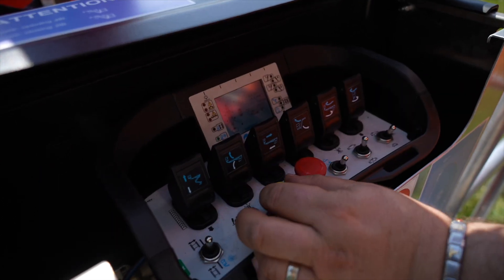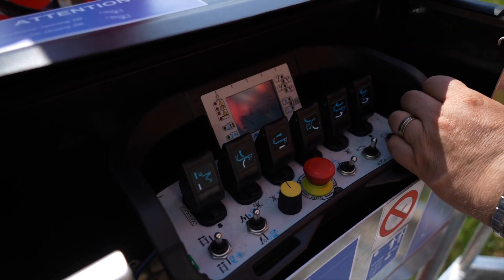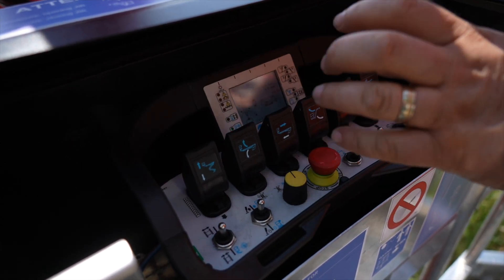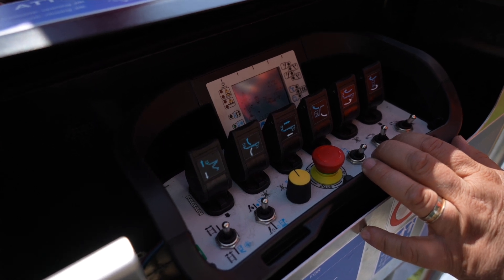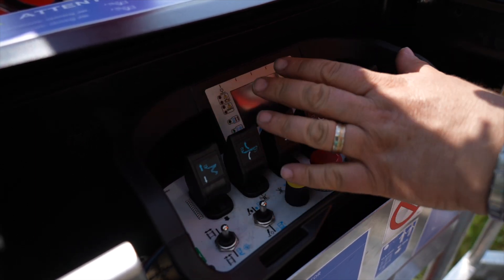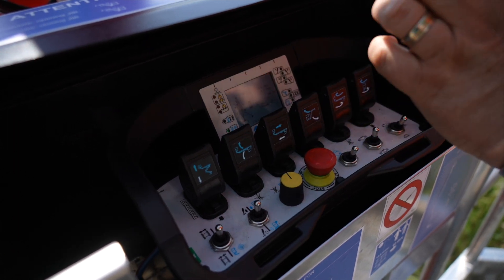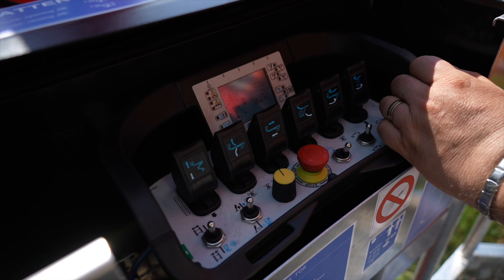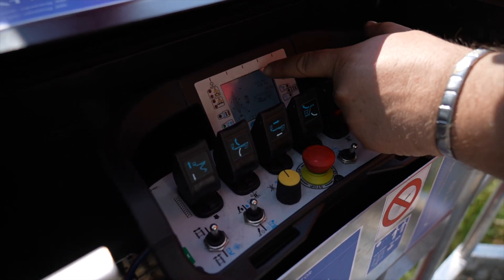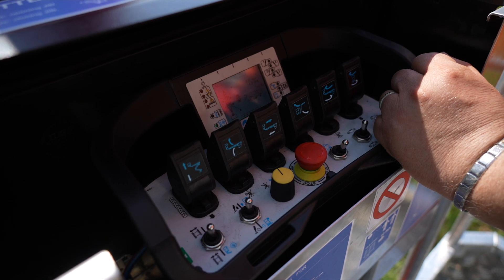The display can also select aerial maneuvers once the machine is stabilized. Every single maneuver is checked and monitored through the entire working operation, showing which direction the joystick can be used and which maneuvers are available — depending on anti-collision limits or maximum performance limits. We can also see traction direction and the angle of the unit with respect to the ground.